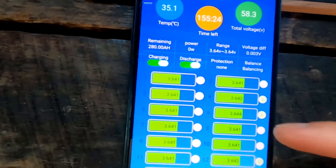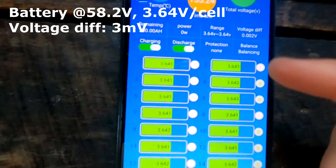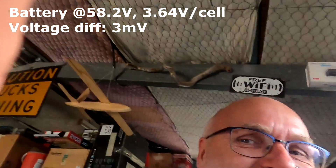For a special occasion I have to interrupt the video I'm recording right now. As you know, two weeks ago we calibrated the battery to 3.65 volts with the Victron smart shunt. Everything was 100% — the battery wasn't 100%, the smart shunt was 100%. Then I turned off the recalibration for the smart shunt, so it won't auto-reset to 100% at a certain voltage. I wanted to see the true state of charge of the battery, so from 100% we went all the way down to 9%.